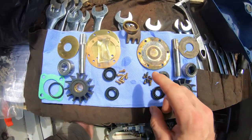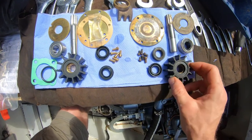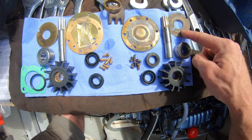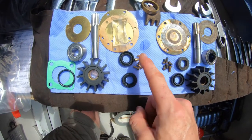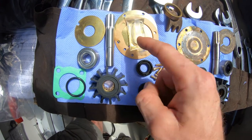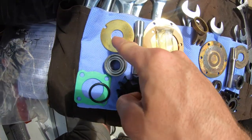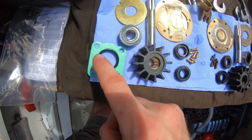So here you can see laid out before me all the old parts on this side. It's the impeller that was in there, that is actually still okay, but we'll put it in a bag and save it. The old lip seals, the old shaft, the bearing, the wear plate for the inside of the back of the pump, the front plate, the old screws. So here we've got the new screws, new lip seals, and the silicone pre-lube. Pre-lube it before it runs up, which you must do, otherwise they burn out very quickly and destroy the new impeller. Gasket, new front plate, new wear plate for inside, new shaft, new bearing, new case body, gasket to the engine,